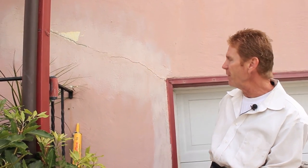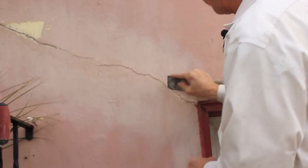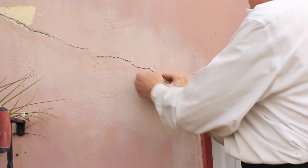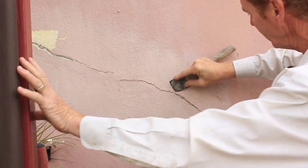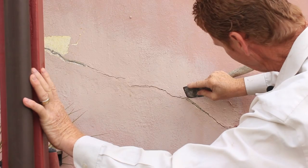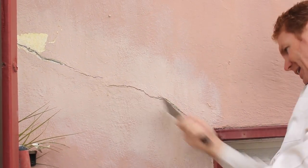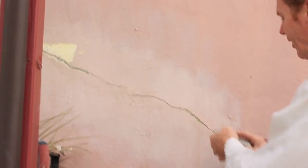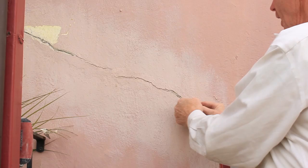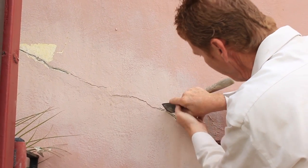The first thing I'm doing is gouging it out. This part's a bit of a drag — it's boring and time-consuming — but you just gouge it and open the crack up. I normally have a three-in-one painter's tool that I put in and pull, which works really well, but I can't find it today so I'm making do. Right now I'm removing old caulking the homeowner put in about 10 years ago.